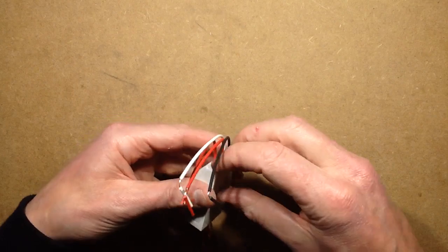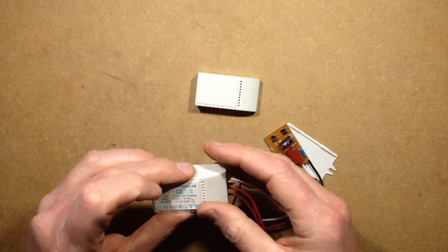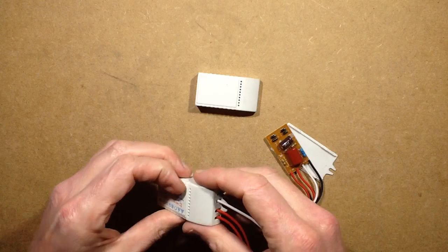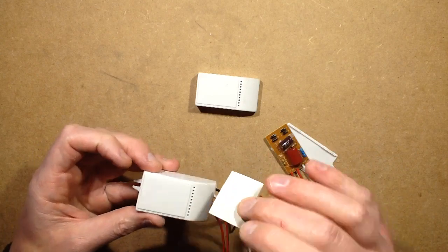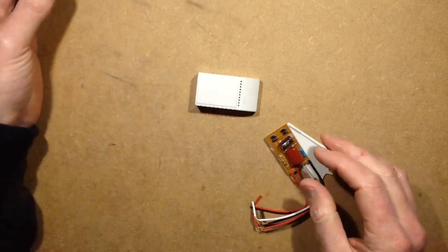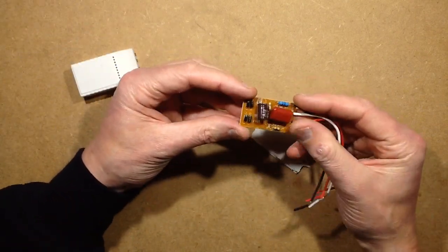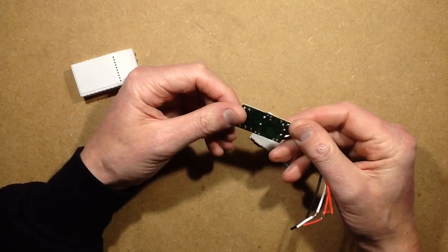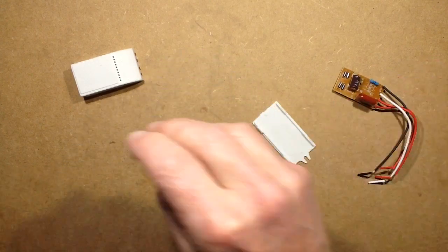So inside these little controllers, they come with these shonky labels that are just sort of hanging off. If they're not off when you get them, they'll be off soon afterwards. They just fall off, they never stick on right. And inside is the stereotypical capacitive dropper like you might find in an LED lamp. So this one in particular, let's draw the schematic.